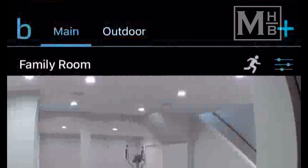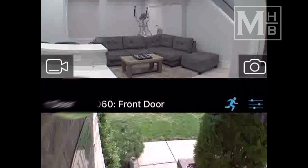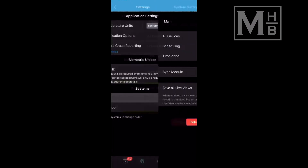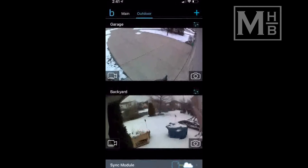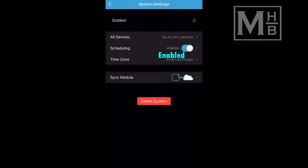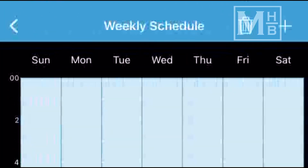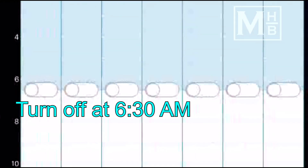In our case, we assigned the front door camera and the indoor camera to one of the sync modules. This one is not on a schedule and stays on 24-7 so that the front door can be monitored always. The indoor camera remains disarmed and is only used manually. For the driveway and backyard cameras, we assigned those to the second sync module and placed it on a schedule. You can, of course, schedule this to your specific needs — in our case, these cameras become active at night and remain turned off during the day.